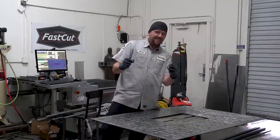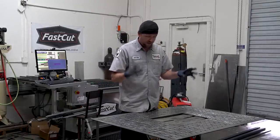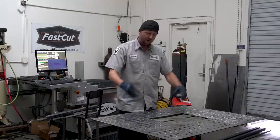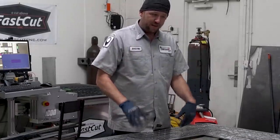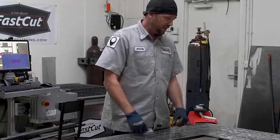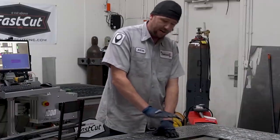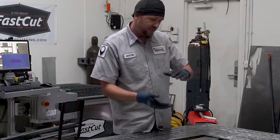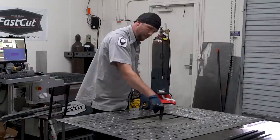3/16 material as it sits right now is not like the most stable anti-warpy type of thickness that you would normally go for. It'll do for a lot, quite a bit actually, but we do have to kind of make sure that it resists the urge or the ability to warp, distort, or move around. So that's why we have some slats that we're going to add on to here, which will effectively increase the thickness and fight distortion.